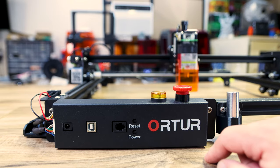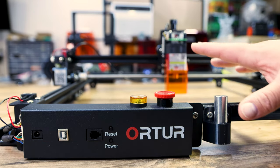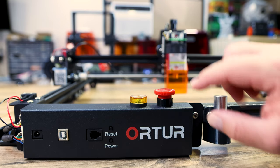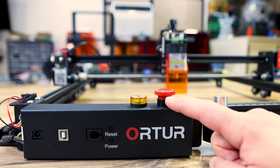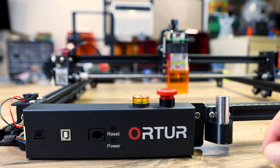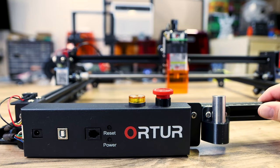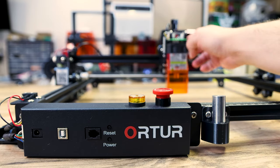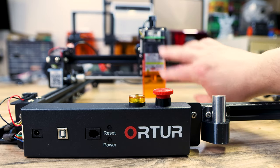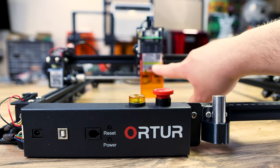Talking about safety features, the first one you can see right away is this emergency stop button. You push it down if you need to — it'll cut the power to the laser and it won't keep firing. Remember to release it by turning it and letting it pop back up before you try to do any burns. On the back it has fire detection, so if it sees flame it can shut the machine down. Also, if you tilt the machine at all, it will detect that and shut the laser down. If the laser is burning and stops in a stationary position for too long, it'll cut the laser diode as well so it doesn't just keep burning down.